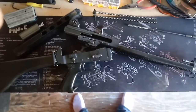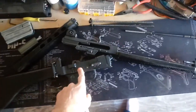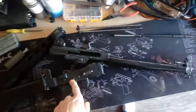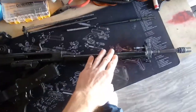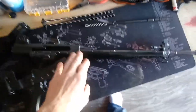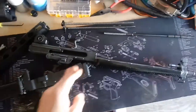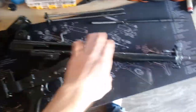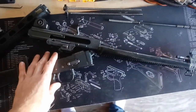But let me say, if this gun got a tenth of the attention the AR-15 did for military trials, this would have been an excellent gun. Excellent. Because the new operating system, it's not direct impingement. So that means it's going to run cleaner in the chamber aspect of the gun. There's no hot gases blowing back into the action. It's all contained in the gas system. So you got a cleaner running rifle. You got a nice gas piston setup, which means it's going to cycle more reliably.